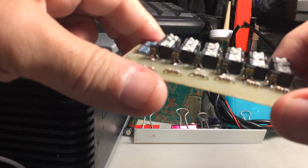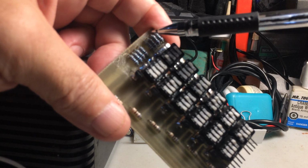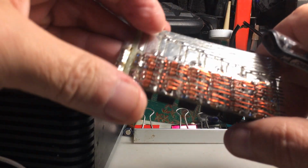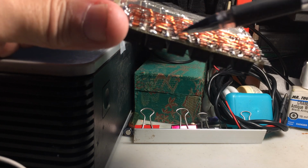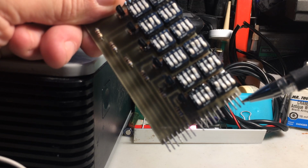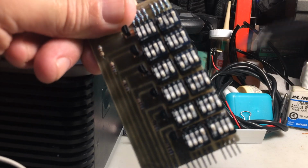So if I wanted to start over, I could just turn all these switches off, okay, and they would all be high, because with the switches all off, the 5 volts that is on this side of the resistor appears on the other side of the resistor, which feeds directly to the output through these wires on the back. It just jumps from the resistors to this side of the switch, this side of the switch, and so on until it gets to the output. So with all these switches off, all the outputs are high, which represents basically an EPROM that has been erased, because usually EPROMs that are erased all have ones or high output, which indicates an erased EPROM.